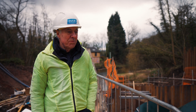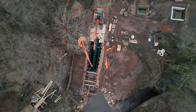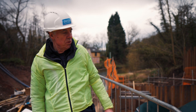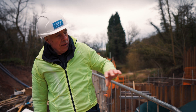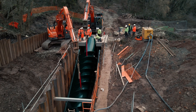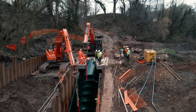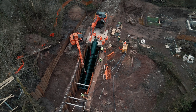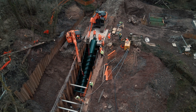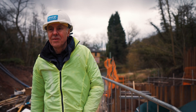Then we're ready for the next phase: building a powerhouse structure on top of this slab. Once that's built, we'll start putting the electrical equipment in. At the top end of the Archimedes screw shaft there'll be a gearbox, coupled to an asynchronous electrical generator. We'll also have a control cabinet in the back of the powerhouse to control the speed of the generator. Then we'll be ready to connect the electrical supply — a big cable running from the bottom right-hand corner of this slab back into the factory at Siemens on Eaton Bank estate — and we'll be ready to start generating.